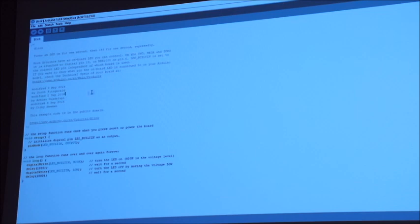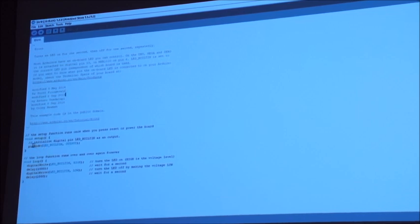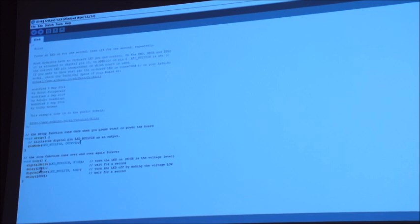Flashing LEDs just get boring after a bit once you've got some stuff. So this one, just quickly, will first of all say I am going to use a pin called the LED built-in. It's an output, and this is a digital pin, on or off. Literally what this does here is it writes the built-in LED as a high, it waits for a second, and then it writes as a low, and then it waits for a second. So surprise, surprise, it flashes an LED every second.